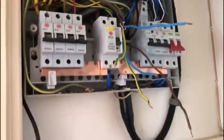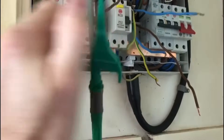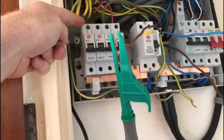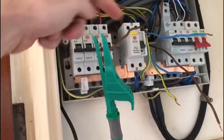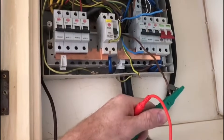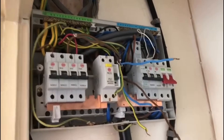One of the checks I've done is to see whether this ring circuit — which is only controlling two sockets in the kitchen — is somehow connected to the other. I linked the line across but it's saying it's not. That's sometimes a problem where two ring circuits have been linked and gotten the wrong way round — but that's not the case here. I'll do the same on the neutral.